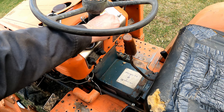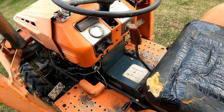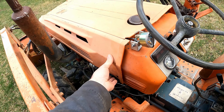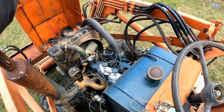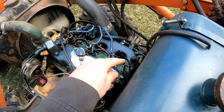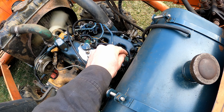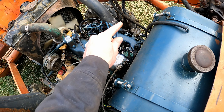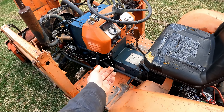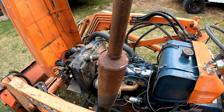Let me start this one more time, because I'm seeing this and it says off too. It's got the fuel cut on that side and this one — that looks like a decompression, actually. Yeah, that's exactly what it is. So that's another shut-off, or if you're having a hard time cranking it over, you pull that to get it cranking and then release it to get the compression. Kind of a nice feature.